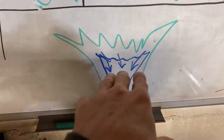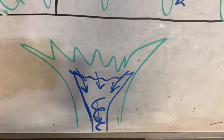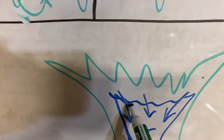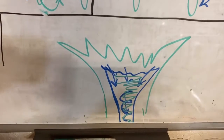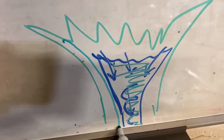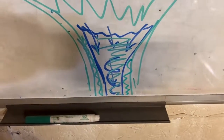In the flame we're seeing a figure that looks like a cone right out the end of the nozzle here — it looks the same way a tank of water with a bottom drain would look after you pulled the plug out of it. Essentially all this area inside of here is burning hotter than everywhere else — that's why it's shining a little brighter. Maybe it's oxygen deprived and that's why it's not burning blue, because we also have an area of blue combustion taking place right on the edge of it, and there's a black zone right up in here.